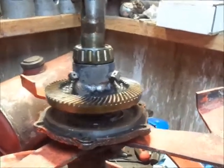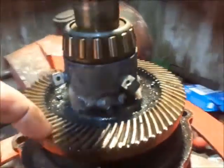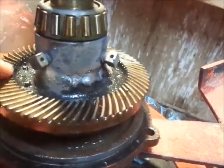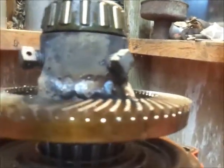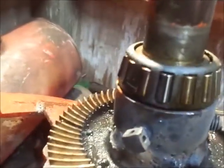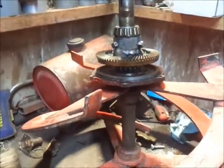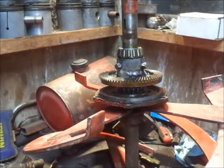I'm gonna put her back together and chip a little bit. I got a little bit of slag that fell down on the gear and is stuck to it, so I'm going to take a chisel and just knock that off. I don't think the gear is damaged or anything. It looks alright looking at it by eye. All I'm gonna do is knock the slag out of this thing, stick the gearbox back together, put her back in the blower, and wait for some snow. I'll use some YouTube magic and it'll be back together in the snow blower.